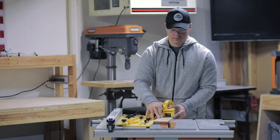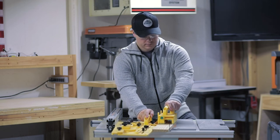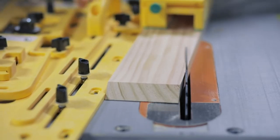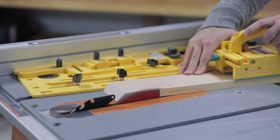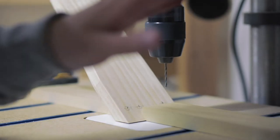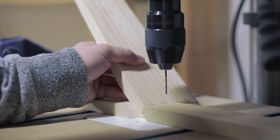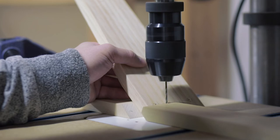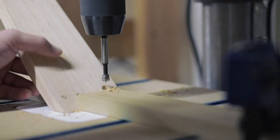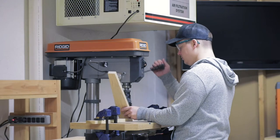After I cut my legs to length I went ahead and tapered them just to get a bit of a cleaner, polished look. The jig I'm using is pretty awesome but also very extra. If you don't have any kind of taper jig you can easily build one with a couple pieces of plywood and a miter rail — you just want a way to secure the boards consistently on some sort of sled so that all of your tapers turn out the same. The final step to finishing up the legs was to pre-drill some holes for attaching them to the long strips. I wanted to use three screws for each, so I was careful to mark out where I wanted them and made sure the marks were offset by a small amount on opposing legs so the screws wouldn't run into one another. I used a couple pieces of scrap wood and some clamps to form a 45-degree base on my drill press, then made all those pre-drill holes — first drilling straight through and then coming back with a Forstner bit for a countersink.